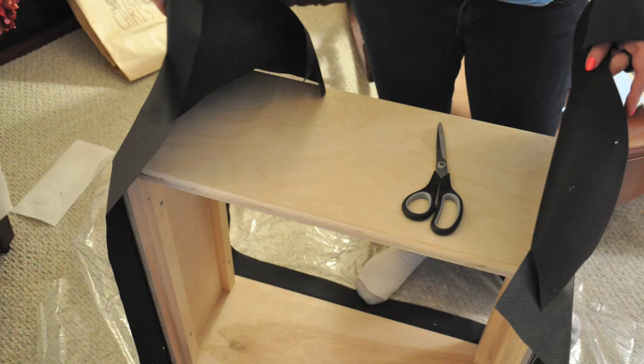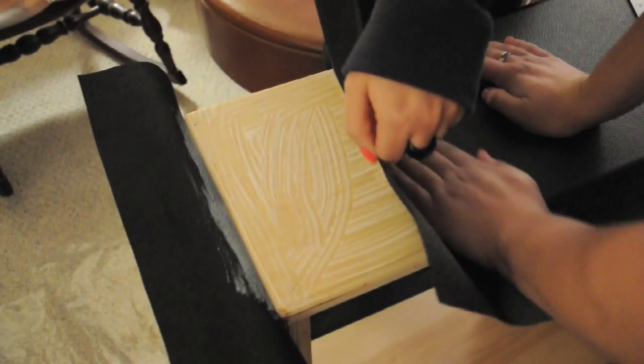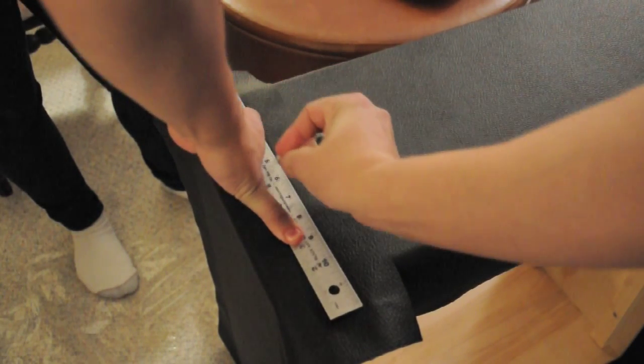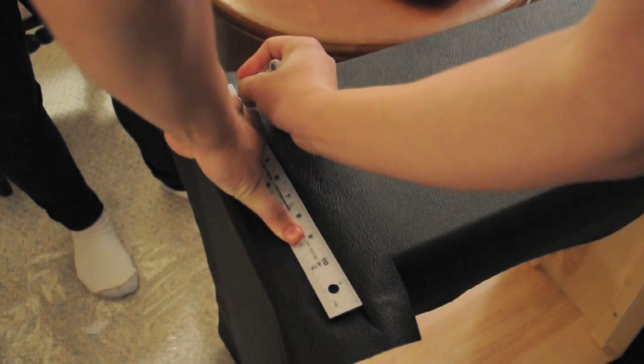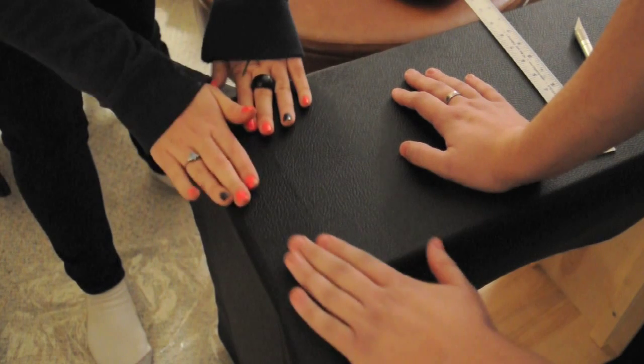This left two side flaps on the bottom that were not glued down and didn't reach each other. I took another piece of tolex — the bottom piece — that more than covered the gap. I cut the side flaps down a bit to be more manageable, then put down glue in the middle of the bottom of the cab between the side flaps and also to the bottom piece of tolex. I smoothed the bottom piece into place and smoothed the side flap down to overlap it. I then took a metal ruler and scored through both layers about two and a half inches in from the edge of the cab. Just lift up the side flap, peel up the cut edge of the bottom piece, then smooth the side flap into the glue and it'll match up perfectly. In person the seam is completely unnoticeable, if not invisible.